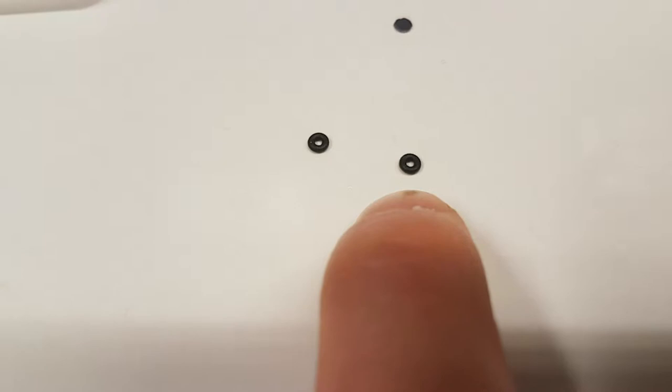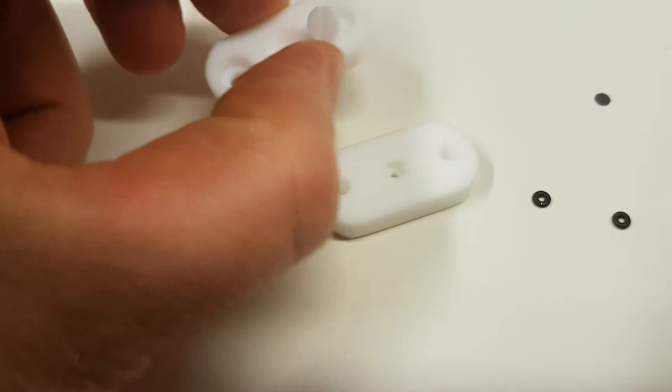what we've actually got here is, for example, and you can hardly see it, and that's a good thing, a piece of silicon with a nanopore right in the middle of it, and that nanopore might be on the order of about 30 nanometers in diameter. What we're going to do in a bit is sandwich the silicon between two O-rings, and the O-rings are going to sit in this well like this, and then we're going to clamp down on top like that. So then we're applying pressure and sealing